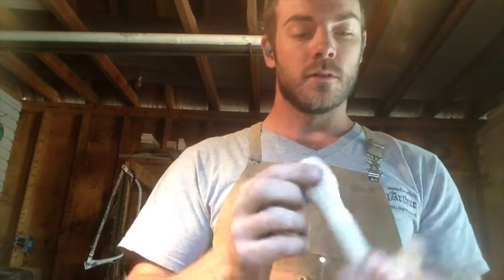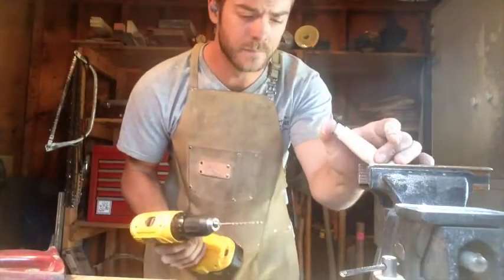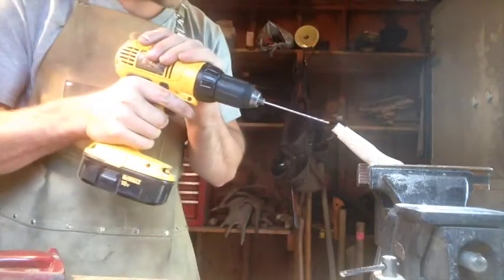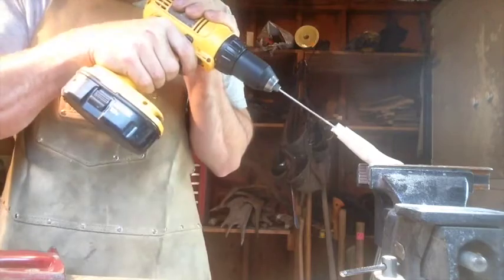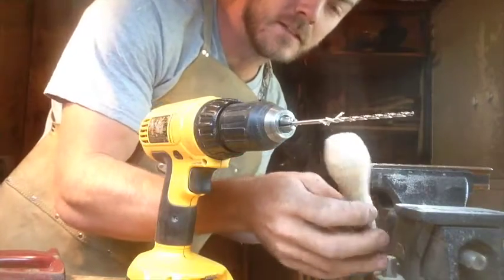I have to go all the way through and come out the bottom in the center. So what I might do is drill from both ends and hope to meet in the middle. That way, if I'm drilling and I'm off a little, I don't end up way off on one end. I could be off a little here, off a little on the bottom, and they'll kind of correct in the middle. So I've got a drill press, but I think I like my chances better eyeballing all the way around it and keeping it chopped up in a vise with just the hand drill. Like, got a lot more maneuverability with it that way. Luckily, I've already got center marked on the back side of this from the lathe.